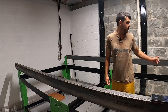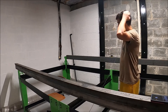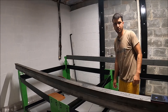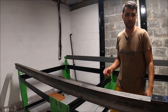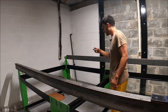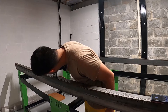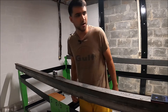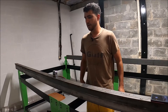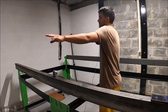Alright, so loosen that side, lift it up, try to lift it up and tighten it again — see if we can get that 0.1 to 0.2 degree discrepancy corrected. I did some swapping. Let's try it again. Zero degrees. Put it in the center — what are we reading? Zero degrees. So at least as far as our digital angle finder is concerned, both rails are pointing at the same angle and this direction of travel should all be in plane.